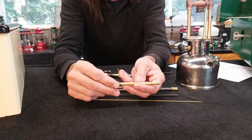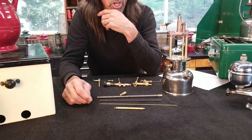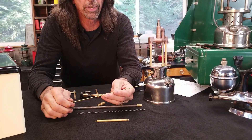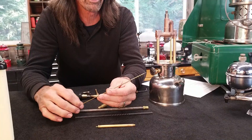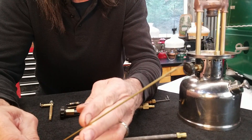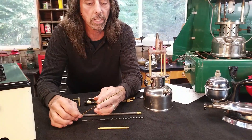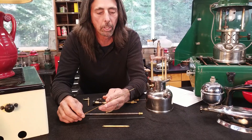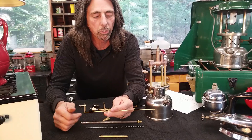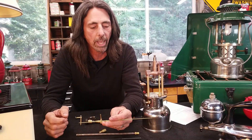On a lantern, if I were to pull it out, you would find a piece of cardboard or some asbestos depending on the age, or there may also be a small spring down in there. The other piece inside of the generator is called the tip cleaner rod. The tip cleaner rod has a very sharp needle on the end of it. There is the same thing inside of a lantern generator, but it is much smaller. What this does is it goes in and out of the gas tip and keeps the small orifice in the gas tip clean. On a stove, the tip cleaner is controlled by when you turn the valve on or off — this extracts from and then goes back into the gas tip to keep it clean.